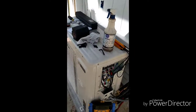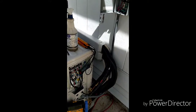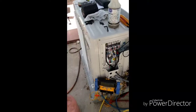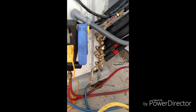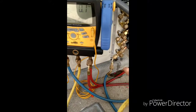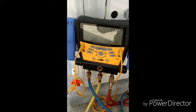Check your fittings up in the attic too, where the air handlers are up in the house — make sure you've got no leaks there. After you do that, take out your nitrogen or Freon and you can leave your blue line hooked up to your gauge still.